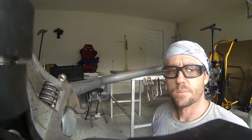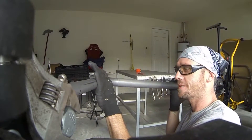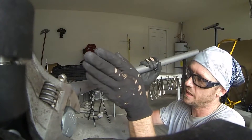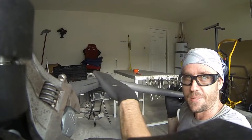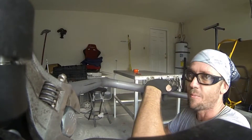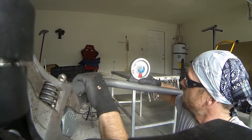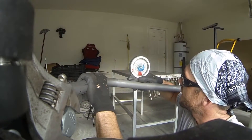Now let's figure out our offsetting. I've thrown it into the die, set the marking up exactly where it needs to be, and I've tightened it down just enough to give me a little bit of twisting and turning room. Don't get too wrapped up trying to figure out which way it's got to go — one tube is going to have to bend left and the other one right, which translates to this leg being up or down. This tube, in order to fit on the right side, is going to have to bend downward because the bend starting from the bottom bends left — that translates to down inside the die.